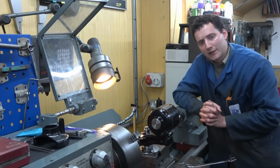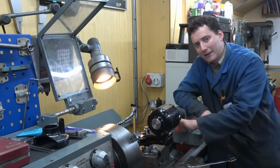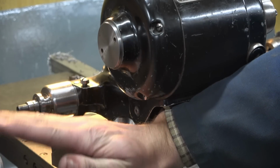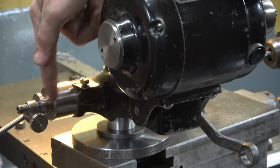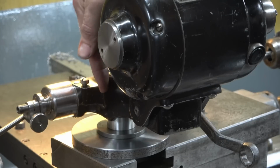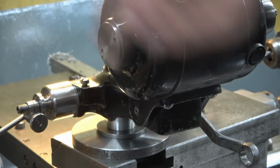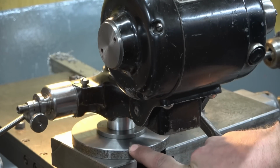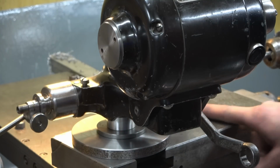Point number 4 was raised by quite a few people, and I'm going to try and answer this fairly quickly. Before I begin, let's have a look at what I said in the video. So there is an error in the spindle this way on. Now, what could contribute to that? Well, obviously the bore to spindle relationship is important. The flange face to post relationship is important. I already know that this is in the clear because I've measured it for parallel, but equally the top of this slide versus the spindle relationship also matters.